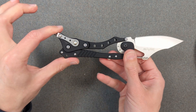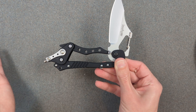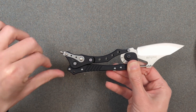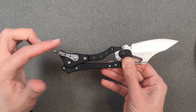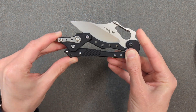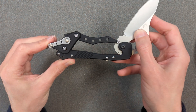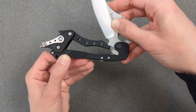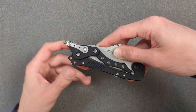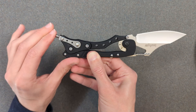You can accidentally get it to stick in this balanced position. When you pull the lever all the way down, it's rotating right to that center point — and you can just let go and it'll stay there. Which means to actually open and close this, you have to kind of bounce your hand up and down; you can't just squeeze down. You have to bounce it because you have to allow this to move back up, so this bar can move down towards the other side. In practice, the way this works is by relying on the momentum of the blade — as you're closing it, the momentum of the blade carries it past the inflection point, and now the spring tension wants to push it all the way closed. But you have to let up on that for it to work.